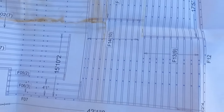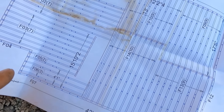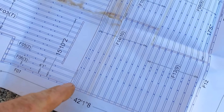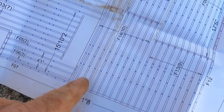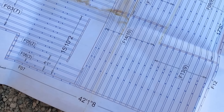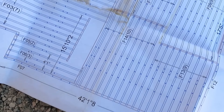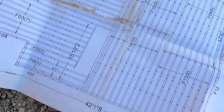Here's how the plan works: just a 16-inch layout, all like trusses. I've got an extra one here because I have a toilet right there. You can't cut floor trusses like you can floor joists, so I've got to have an extra one so I can figure out where my toilet is, spread that apart, and make sure I hit it without having to cut a truss.